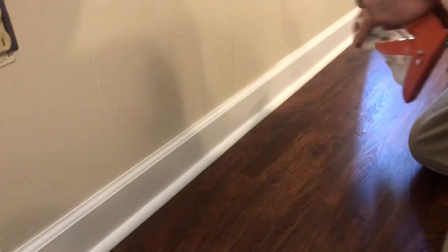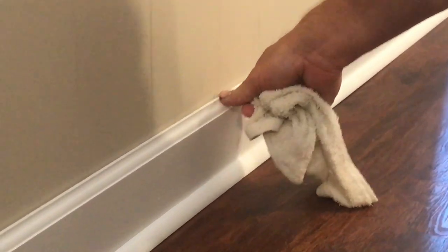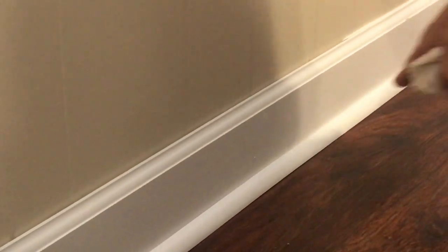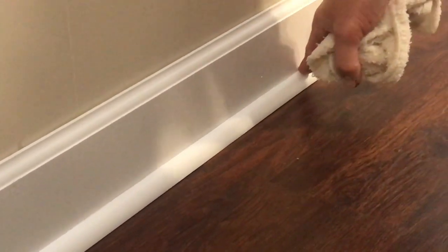We're going to come down here. You can see where the baseboard didn't quite pull up tight to our panel wall, in between the studs. So all these little gaps here and there, we'll caulk all that up and they won't even be as noticeable afterwards. In case the shoe mold didn't pull up quite tight either — see, there's just a little bit of gap right there. Paint would probably fill that, but just in case it doesn't, I want to go ahead and put a bead of caulk through there before I put my final coat of trim paint on.